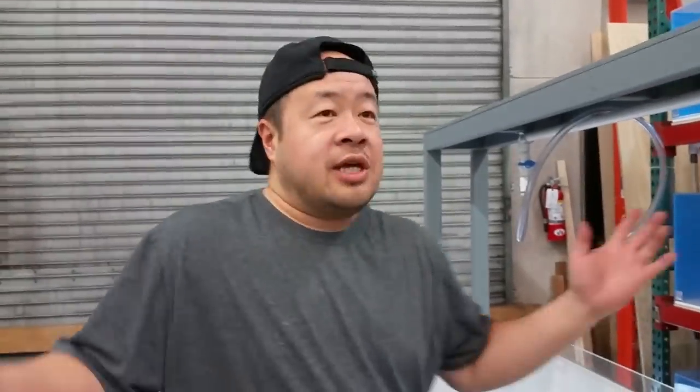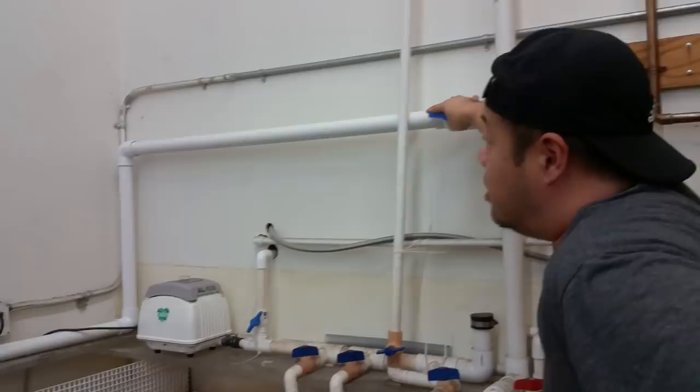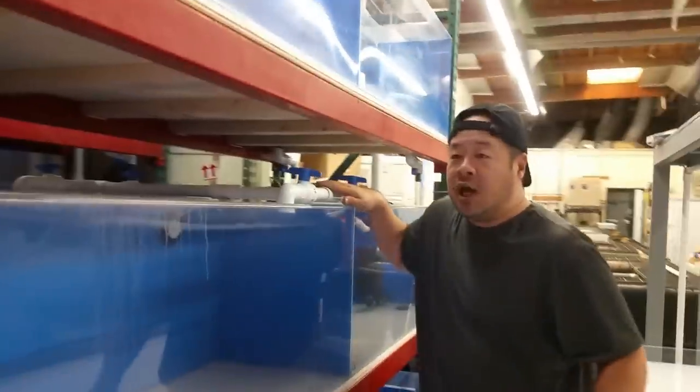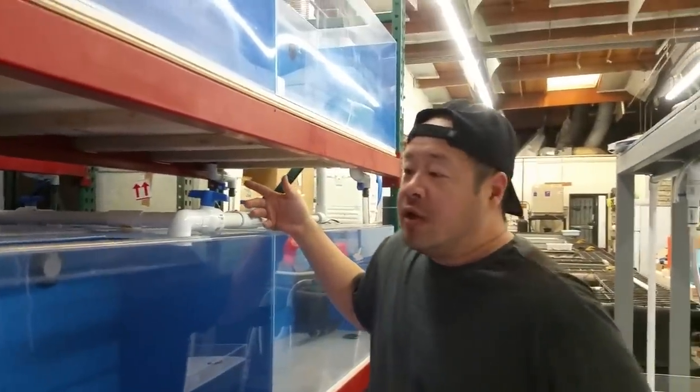So what we're going to do right now is I am going to fill this system for you. I have not filled it at all, so hopefully everything was plumbed correctly — no leaks, everything properly glued, everything joined the right way. This is that moment where you find out if all that hard work paid off or if it's going to be a disaster with leaks and things I now have to shut down and fix. So here we go — I'm going to go open the main line. The line is now pressurized, so there's water coming through these lines. The very first time opening up the line, it's best to let the water run a little bit because there are trapped fumes from the PVC glue in there.